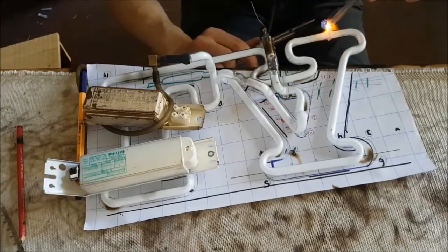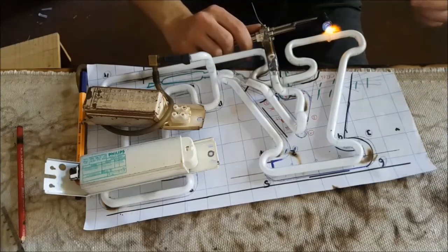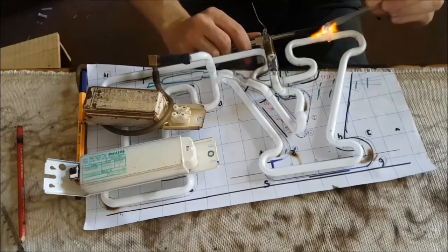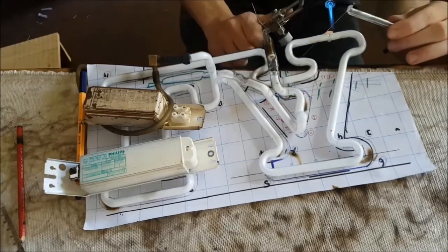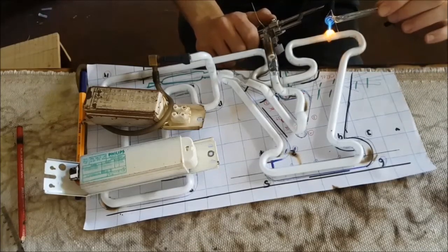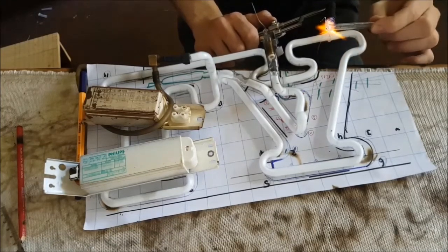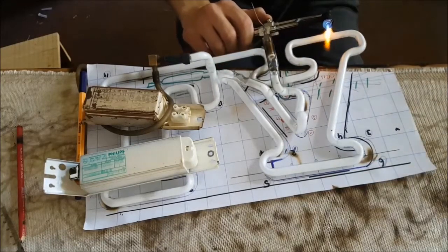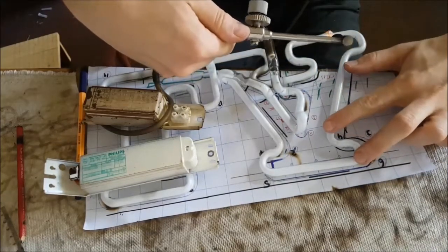And I have a big blob of glass on the weld that's too much, so I'm trying to heat that up again and pull off some more of it. At this point, I don't know if I can save the weld. I'm just trying. Pulling some more excess glass off. And now I'll try to melt and work that blob of glass into the weld, have it flow all around so the thickness is good again.